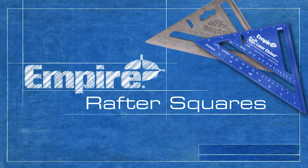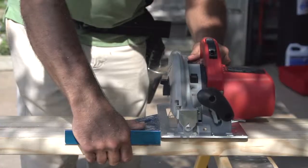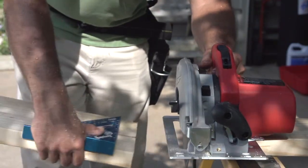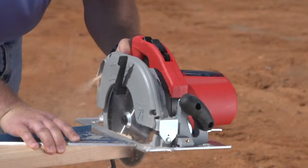Next is the rafter square. Notice the shape — unlike the T-square or the framing square, the rafter square is a triangular square. Rafter squares are used primarily by rough carpenters for laying out and cutting lumber with repeat cuts quickly, such as for rafters or for building stud walls while framing a house. They're also frequently used as a guide for circular saws and as spacers between deck boards.